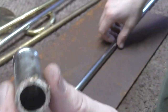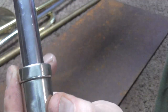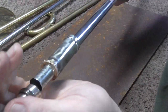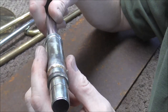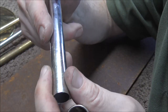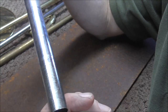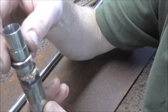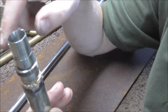There's the cork barrel and the slide tube fits right into there like it's supposed to — so that is good. Now what I have to do is solder this piece onto here. There's a problem though: I need to silver solder these two pieces together and I should have the slide in here when I do it so that it lines up. The problem is that there's chrome plating on this slide, and chrome plating can actually burn if it gets too hot — and this is going to get very hot. So I'm a little hesitant to solder with this tube on there. What I'm going to do is put it on top, tack solder a tiny little spot, and then check it out.